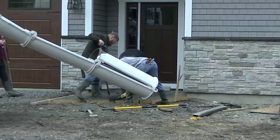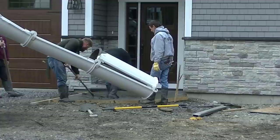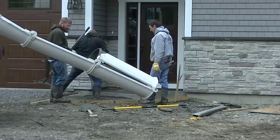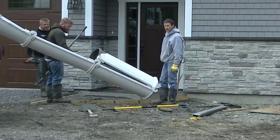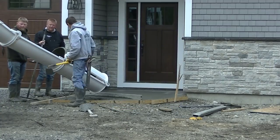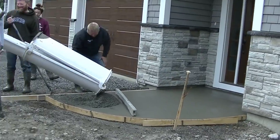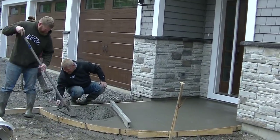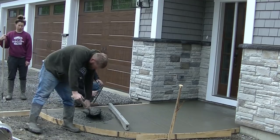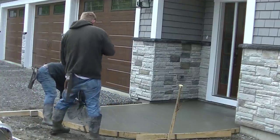We jump right in with the five-foot screed — he's screeding off those magged edges, using them as a guide. When he gets done, the surface will be really, really flat. It gives you a pretty good shot of just how nice that works when you screed off the magged edges. You can also run a screed right across the top of the forms if you want — either way works really good. We had just a little bit too much in there so we'll just shovel it out and make a little pile.